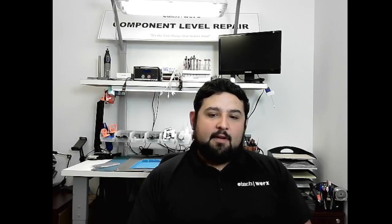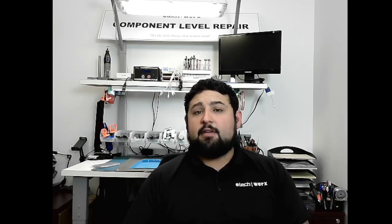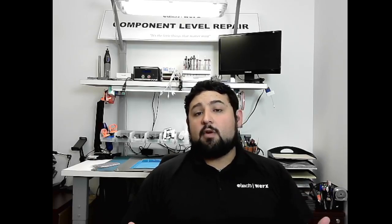Now, when it comes to board level repair, aside from the high margin things, if you have multiple techs in your shop, say 3 or 4, and they're learning or they make mistakes, that can get pretty expensive, right? Because you're either having to replace devices or outsource that repair. A common one we see is backlight damage, which comes from not unplugging the battery and disconnecting and connecting the screen. Another common one is knocked off components or damaged FPC connectors. Again, those are all fairly straightforward to fix, and you could do them yourself with that skill.